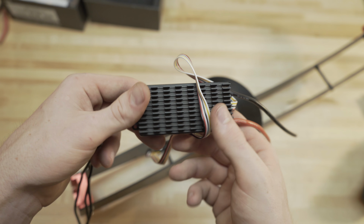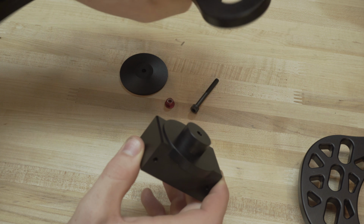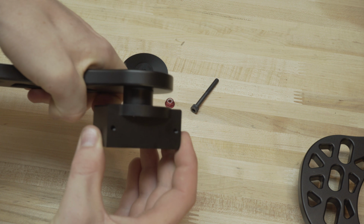Okay, so the next thing we're going to take a look at is just the gooseneck bar. Pretty simple. You got this main piece that attaches to the body, and this bar just hinges around that. So pretty simply, we're just going to stick this in there. It's going to slide around, so you've got a nice free rotation. And then the next step is we're just running a bolt through on this side and putting this nut on. And first, this retainer cap goes on. Line it up, stick your bolt through, and now you're just going to attach your nut.